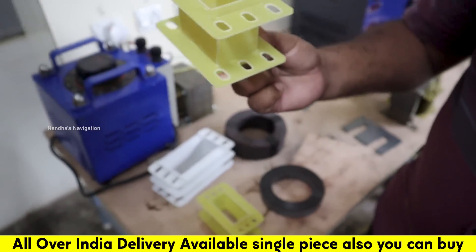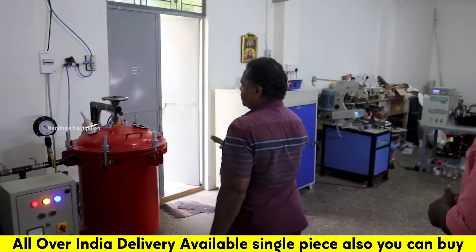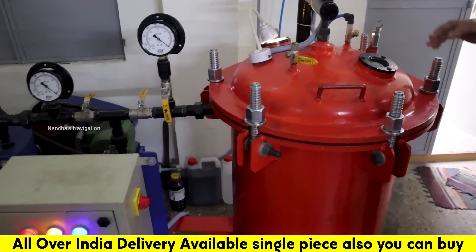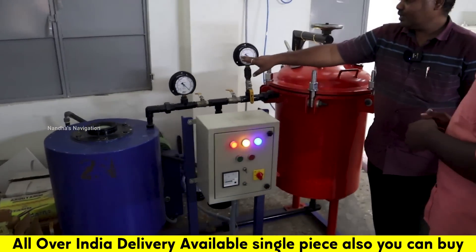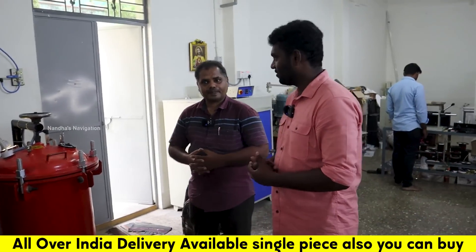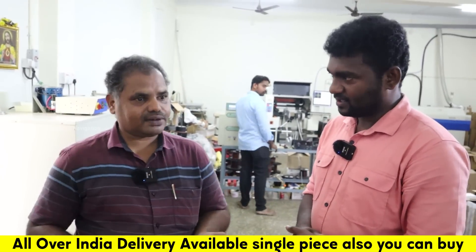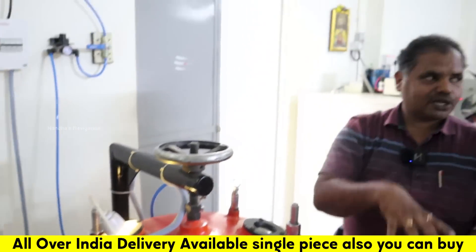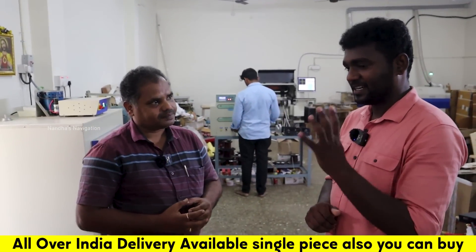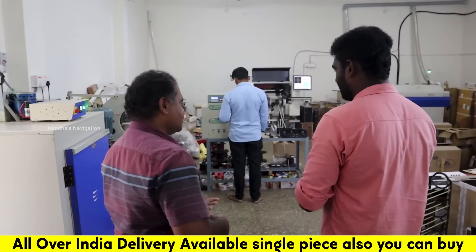We can temper it. This is how much heat is involved. What is the next step? This is a varnishing machine — a vacuum-impregnated varnishing machine. This is the transformer and this is the core. This is the chamber — there is no air, there is zero air. Keep the varnishing for it. What is the main difference? This is the core gap — there is a side gap. The varnish improves the dielectric strength, improves efficiency, and improves heat dissipation. We don't compromise the quality.